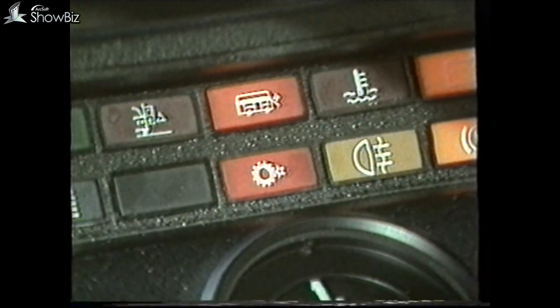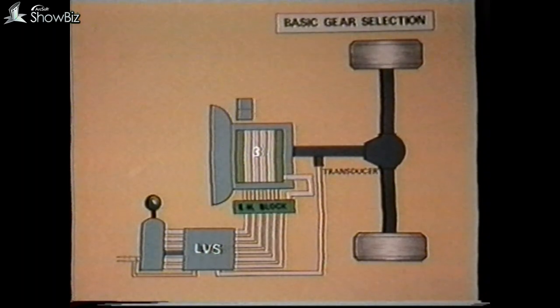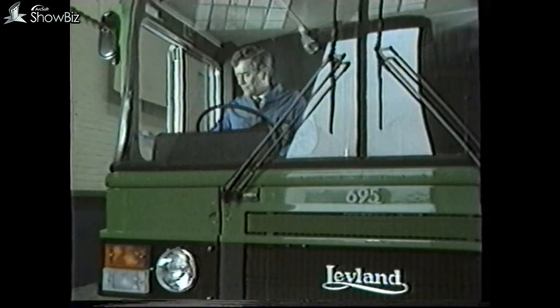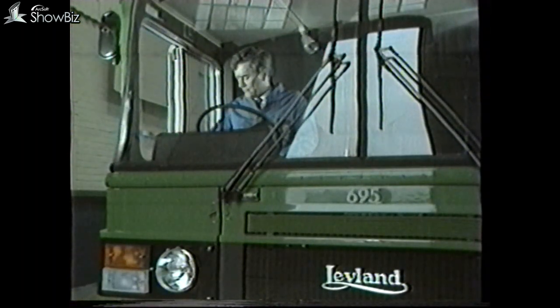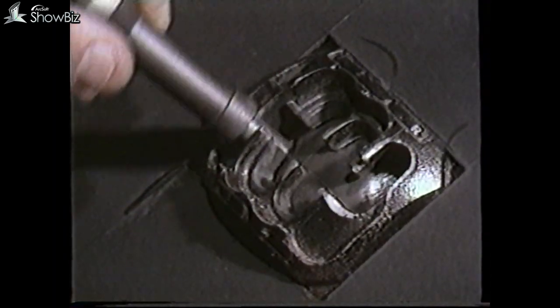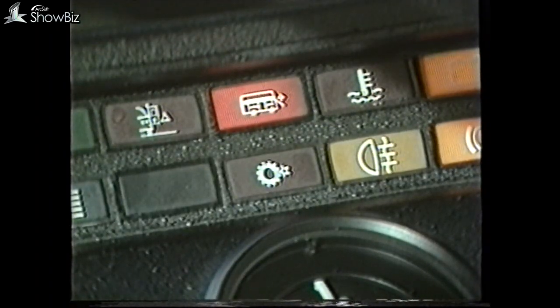On the driver's dash panel there is a lock-up warning light, which illuminates if there is a sudden loss of speed signal from the transducer. If the vehicle is in any forward gear and this loss occurs, selection of any other gear will cause the panel to lock the transmission into fifth gear. This loss of speed signal could be due to heavy braking or a fault. If due to heavy braking, the control panel can be unlocked by passing the controls through a normal start sequence: switch off the engine, place the change speed in S, and restart the engine. The light should then go out and normal gear selection will be available.